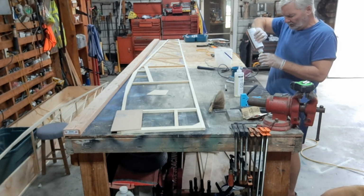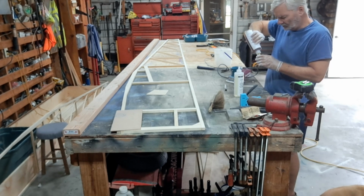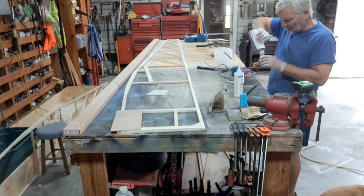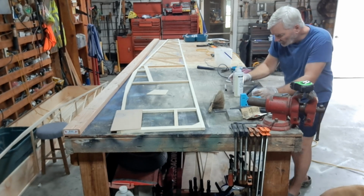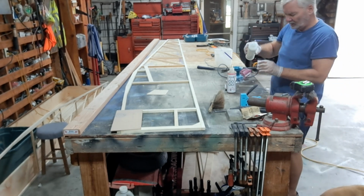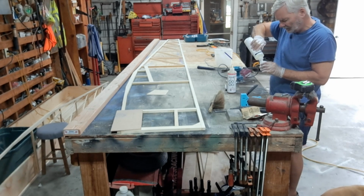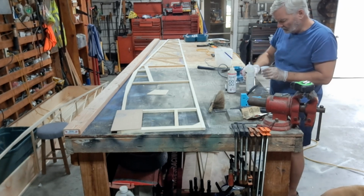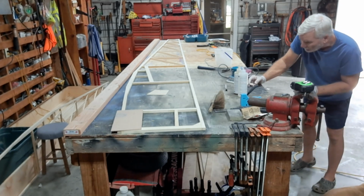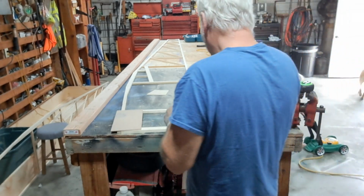Let me see. Notice when you're doing plywood, it takes quite a bit of glue. When you're doing in between the members, not so much. It's hard to measure sometimes. It's supposed to be 1-to-1, so I'm looking at the bottles, but they're not the same exact size bottles, so that kind of throws you off. It'd be nice if they give you two exactly graduated bottles. The resin is about half the viscosity or thickness, and so it tends to run out quicker. Mix it a little bit up here. I can go and mix more.